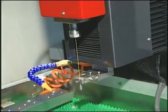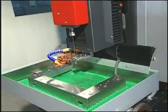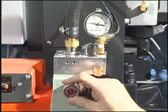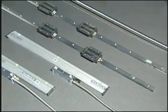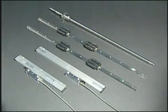TSH-3AA has a submersible stainless water pan, flushing auxiliary pump and high pressure pump with high efficiency. It takes high precision parts for long term accuracy such as linear guide and ball screw on Z axis, Japanese pulse scales and servo motor.